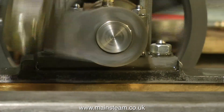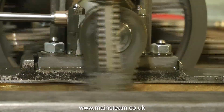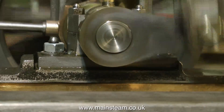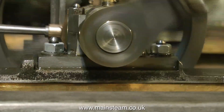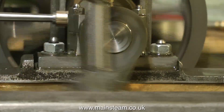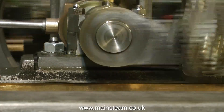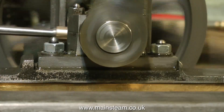There's more, and this is very suspicious. Have a look at the way the bed plate has been machined to take the plumber block. It looks to me like a mistake has been corrected, but either way it doesn't look good — there's a big lug on the left-hand side and an almost machined-to-nothing lug on the right. It would have been better to simply machine the mounting part of the base plate flat, and then everything would have looked fine.